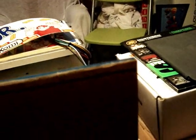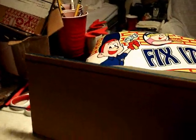Okay, well, the piece that I just cut out using the original Donkey Kong marquee as a template, I laid it on top of the piece of plastic that I had cut at Tap Plastics, and it is identical. So the measurements that I gave them are correct as far as the outer dimensions. The only thing is that the thickness is different. Eighth of an inch is just a little bit too thick. You can force it, but with the protective paper or the decal, I'm sure it'll be a little too thick. So now we've got a proper size cut here.